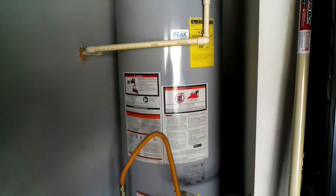The next step is to hook up a water hose directly to the water heater. While you could use a regular cold water hose, I wouldn't recommend it because the temperatures coming out of this water heater are going to be about 140 degrees. I recommend buying a hot water hose specifically made to tolerate temperatures up to about 200 degrees. I'll link it in the description.